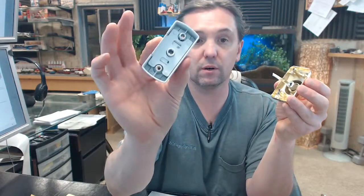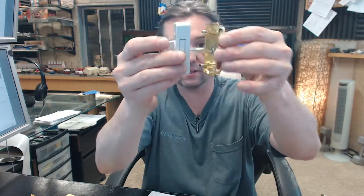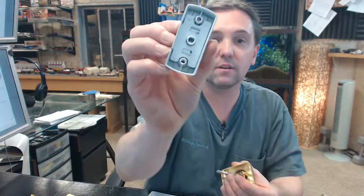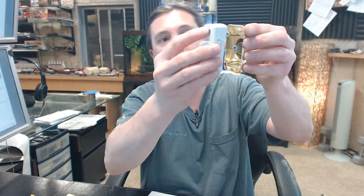Guide this assembly through the top 3 holes in the outside face of the door. Guide spindle into hole in the inside deadbolt. Here. So you're going to need to get all of this connected and put together. You're going to need to make sure that that is in alignment, so you've got enough opening there where you can try to get that twisted when you install it. Just keep note of that and make sure that the orientation is proper on both of these. Okay. At that point, you'll run your screws through.